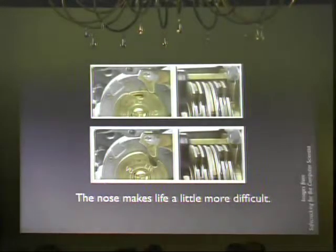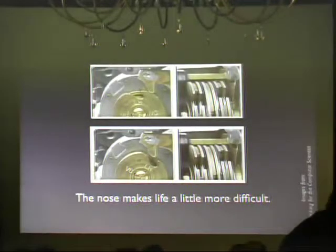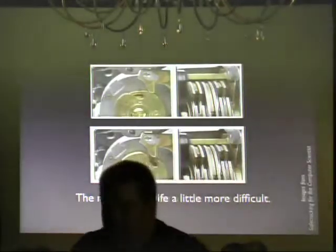The long and short of it is, unless the spindle of the dial is in one particular place, the fence doesn't touch the wheels, which means that no matter how hard you crank on the handle of the safe, and in fact, most safes don't even have you touching the actual bits of the lock directly. It's all interlinked by mechanical linkage. Except for this one particular place on the dial, the fence never touches the wheels, which makes it kind of hard to figure out where the gates are in the wheels, because for most of the revolution of the dial you have no way of getting information about the state of the wheels underneath the fence, except in that one particular place.